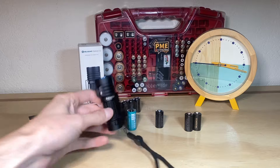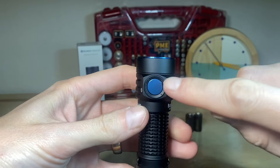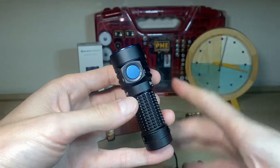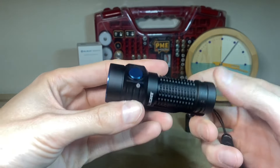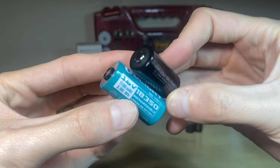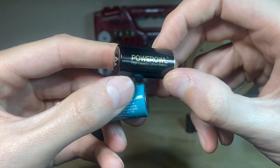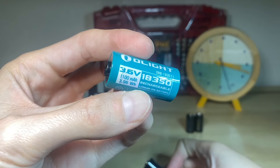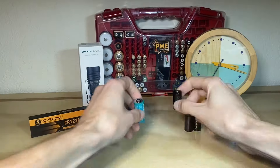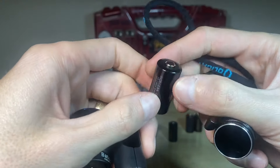So there you have it — the Baton Turbo and CR123A battery combo. Interesting things we found: the status illuminators don't seem to function other than when you first plug it in, when they all turn green to indicate a successful connection. You don't get turbo, but you do still get moonlight through high modes, and those output settings seem to remain the same. One thing I learned is that, somehow — whether it's battery chemistry, a difference in power density, or something like that — even though the CR123A is a smaller battery, more milliamp-hour capacity seems to be in these Power Owl CR123A batteries. The included 18350 is obviously rechargeable, which is a great benefit included with the Baton Turbo, and I'm cool to have the options — more options for the consumer, the better. I'm glad this little light can take its included rechargeable battery or some of these CR123A's.